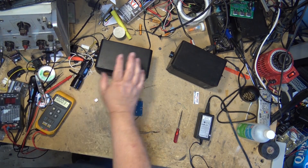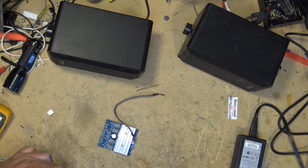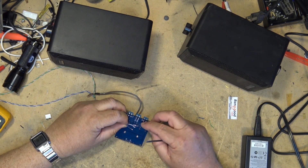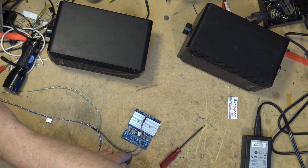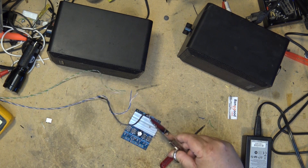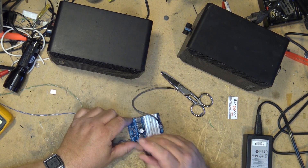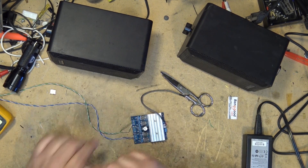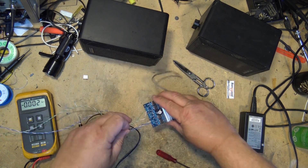Now let's put this thing into practical use. We're going to hook this up to a pair of speakers to see how well it performs. We need to hook up the wires here — I've grabbed some strands from network wire because that'll do the job. We have our positive and negative terminals to tie down to the binding post. I'm just going to trim these wires so they aren't going to short anything out. The same goes for the left channel — the negative terminal is the innermost terminal. Next is my power supply — be careful of the polarity. This is my positive lead, VCC and ground.